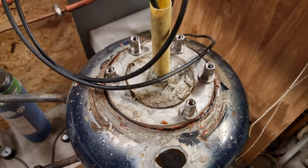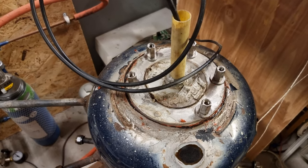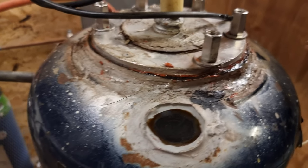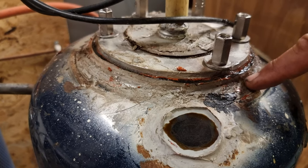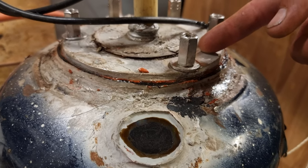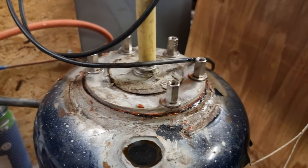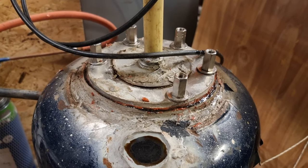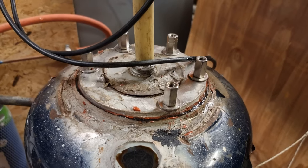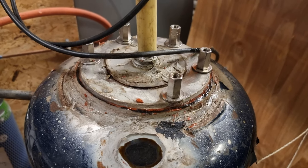How are you sealing that there? It's very difficult to get it closed. I have to use standard, simple components. There's a rubber O-ring gasket, and there is a big steel ring below, and this is a stainless steel plate. You would expect it to be sealed, but the problem is I've spent many, many hours finding leaks and closing them again. Yesterday we found a leak in this one, and there is still a leak in the tank. How do you find the leaks?